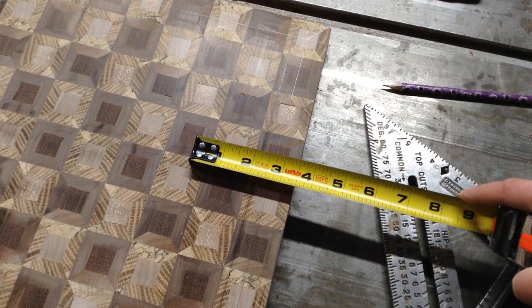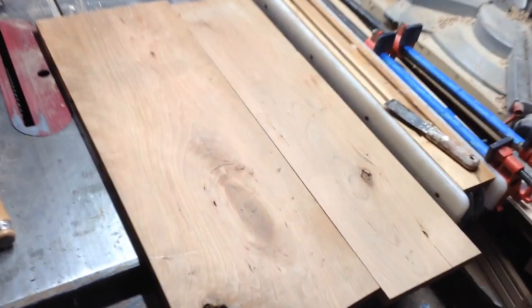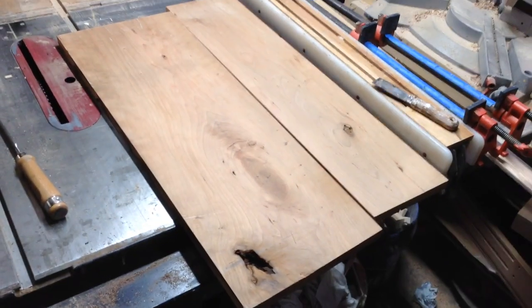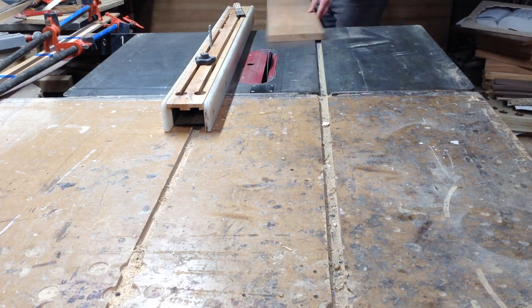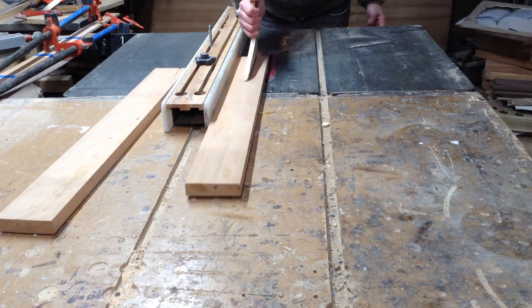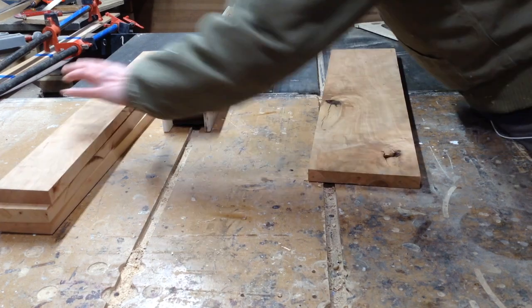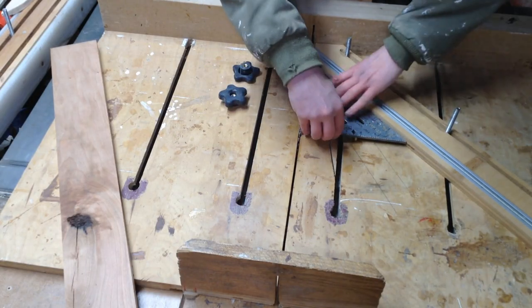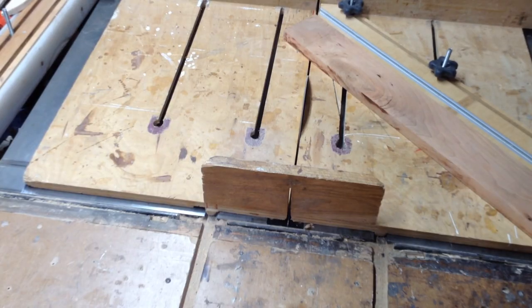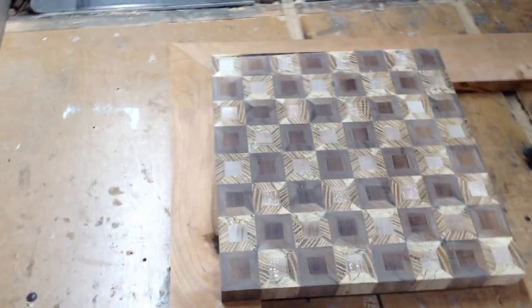For this I'm going to be making a frame that the whole checkerboard will sit in. This design is not mine — there are a lot of people on the internet using a similar design, but the first time I saw it was from mtmwood, which I'll link in the description. He seems to specialize in chess boards and cutting boards and makes amazing work. Basically, you make a frame quite similar to a picture frame, and the inside edge of the board as well as the inside edge of the frame will be rabbeted so that the board — because it's solid lumber — is going to move and flex much more than a veneered board over particle board. That little rabbet will account for all of that flex and hide the movement of the wood.